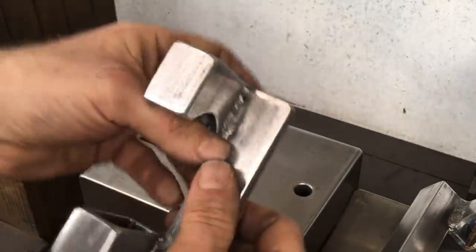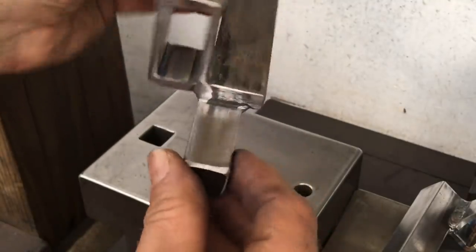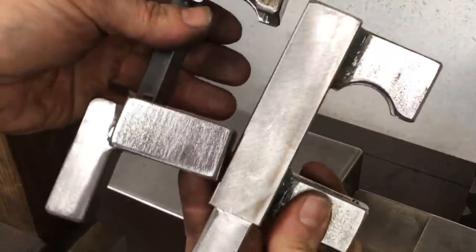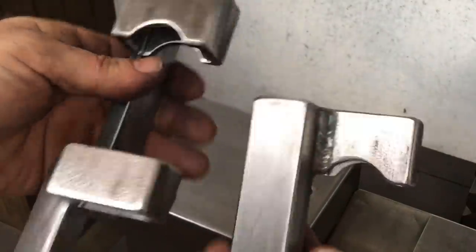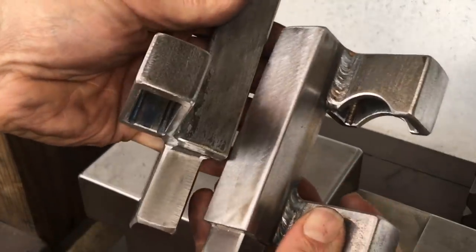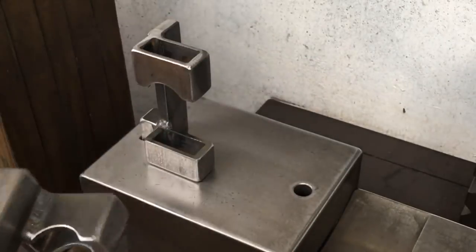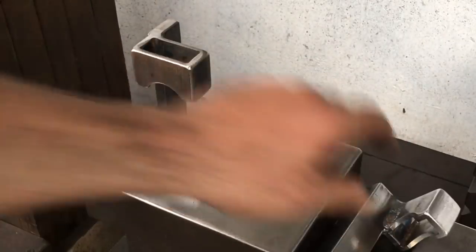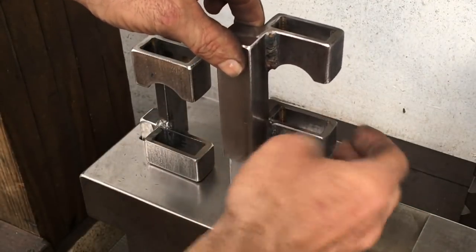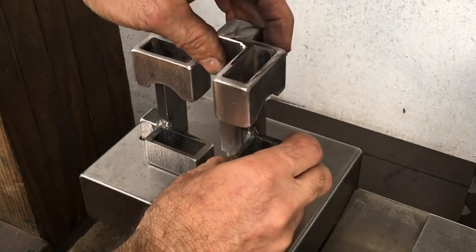So this is my new design. I've used a piece of medium carbon for that supporting piece and you can see how that's much lighter. I don't think it'll reduce anything as far as sturdiness goes because you're not hammering on this piece — you're hammering on the dies. Also, I put the guides to the front of the supporting piece rather than the back, which will help me visually since I normally use it in this orientation.